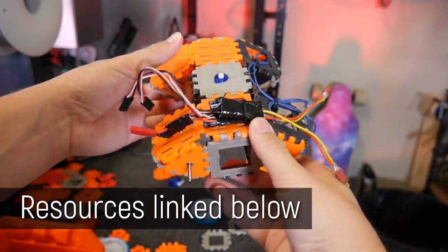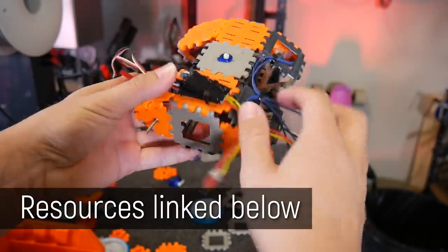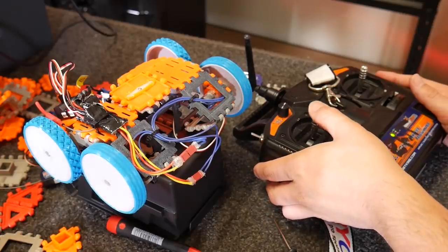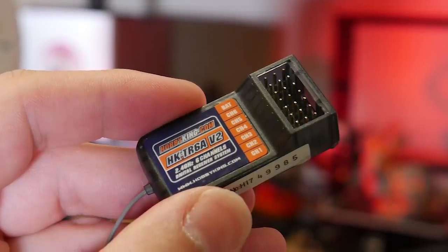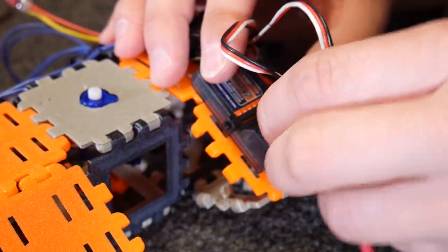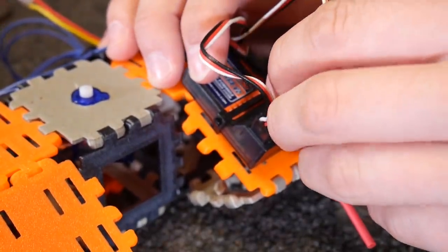To control the motors is a little bit messy and a little bit confusing if you're new to it. I used Bot Bits ESCs — they control the brushed motors using the remote control receiver. The receiver is a cheap Hobby King TR6A, just a cheap six-channel remote controller I usually use for my robots. All the links to this stuff will be in the description to help you understand it further. Understanding how to connect speed controllers to the gear motors through the receiver and stuff can be a little confusing — there are guides online.